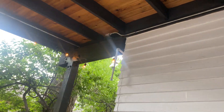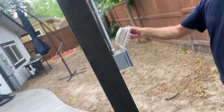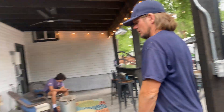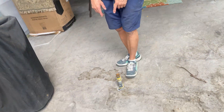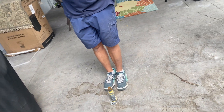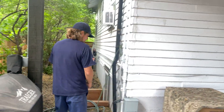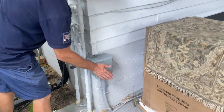We piped all of this and then put some outlets on the back side — constant power and switchable plug. They're going to be putting a gas fire feature here with a couple of metal cabinets, but even though it's not serving a counter, you do have to treat it like a kitchen, so we did both sides. Here's another junction that came up in the cement.